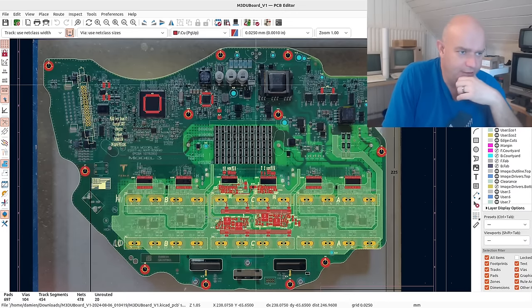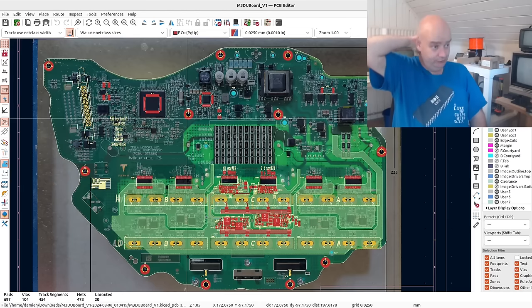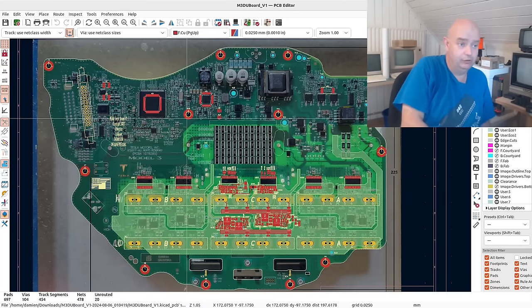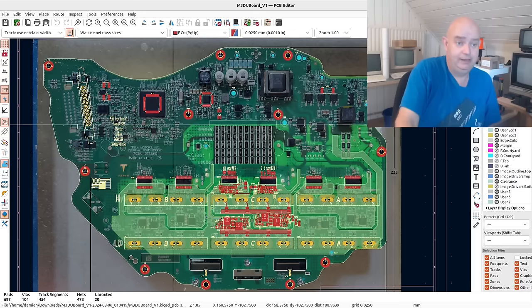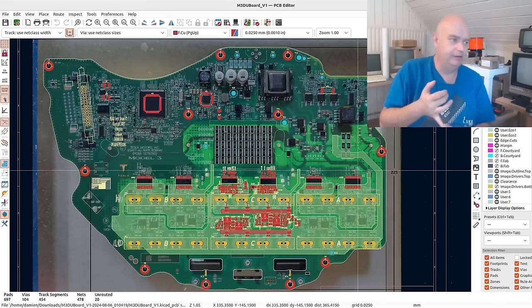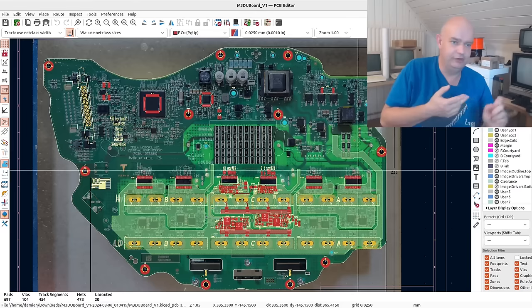Then we can come along and do the rest of our open inverter system. I'll be using two STM32 micros — the standard F103 for motor control, but then I'm going to put an F105 on there whose job is configuring and communicating with the gate drivers, because they are SPI programmed and controlled. I've captured SPI communication logs for them and Colin decoded all that — it's all up on GitHub now. So we know how to program the gate drivers for things like dead times, limits, temperatures, all that good stuff.